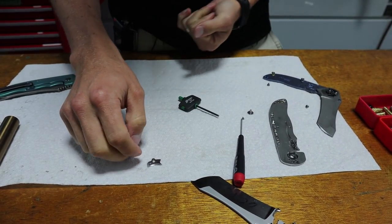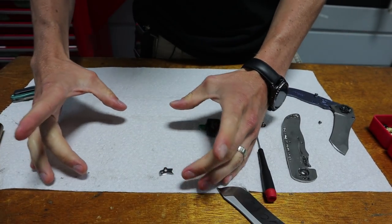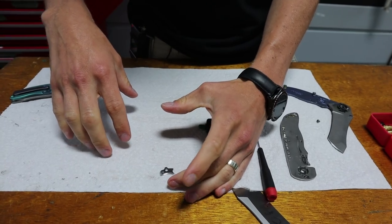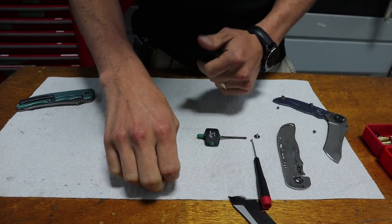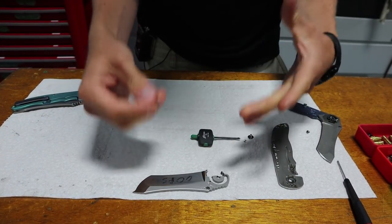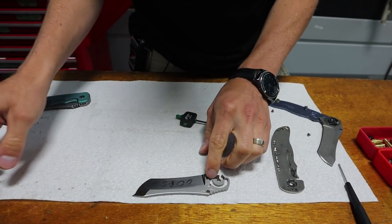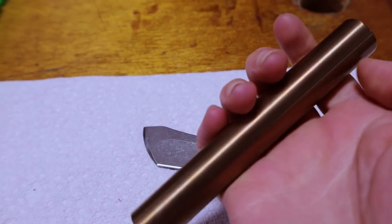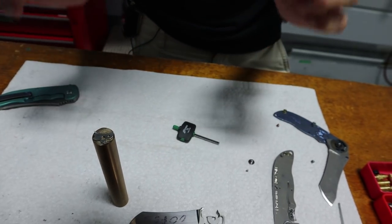And that works okay. And then you leave little tabs. Some people heat treat first, some people heat treat with the nest and tabbed out, and then they flip it over and they surface grind the back or mill the back or whatever. I kind of don't like that workflow. I would rather have a one and done solution. So instead of doing something like that, my theory is to make it on my lathe, just like that. I think I can do it.